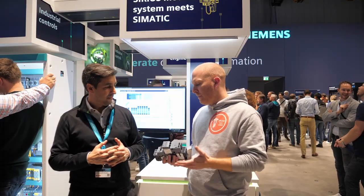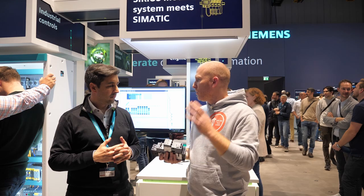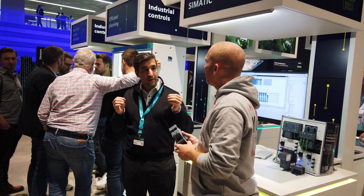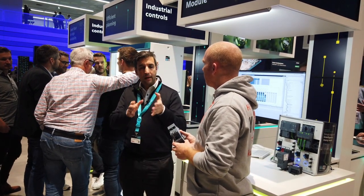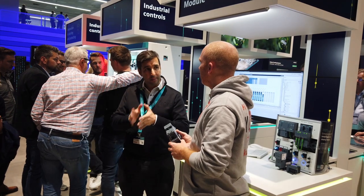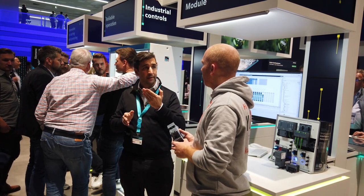Quite interesting. That means we can get more data out of our normal contactors and MCCBs. How to connect this to the IT world? Well, basically this communication is a rack communication, an extension rack from the ET200SP communication, that you can set up to 16 devices, and from the ET200SP you can go via the PLC to the cloud level, or you can even use the ET200SP multi-fieldbus that allows parallel communication with Profinet and Modbus TCP, and then you can send this information to the cloud.